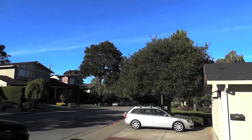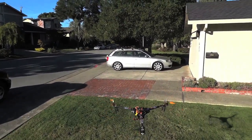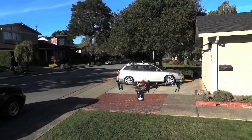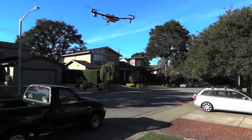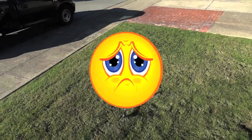And you generally need a little bit bigger motors because you're lifting with three motors instead of 4, 6, or 8. Another thing you have in a Tricopter that isn't so great is there's no redundancy at all. That's also true of a quad, but with no redundancy, if anything fails, I mean literally anything, if your servo in the tail fails, if your motor fails, if your speed control fails, you're going to be losing the craft. It's going to go down.